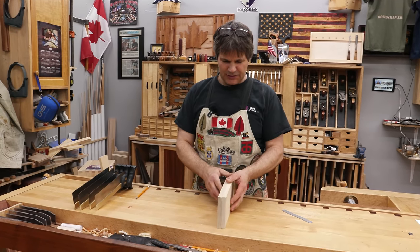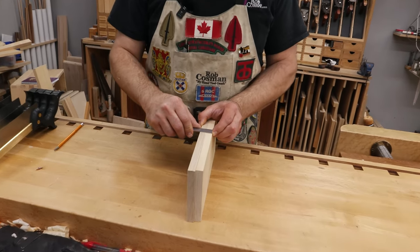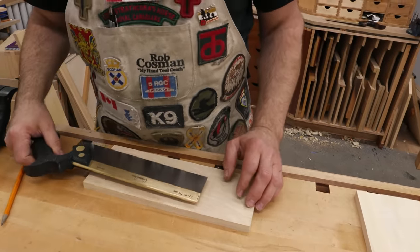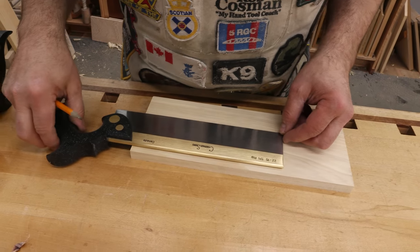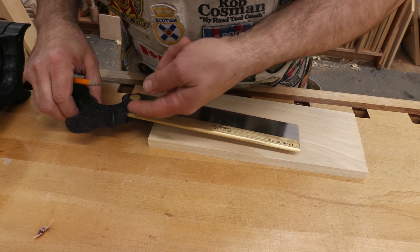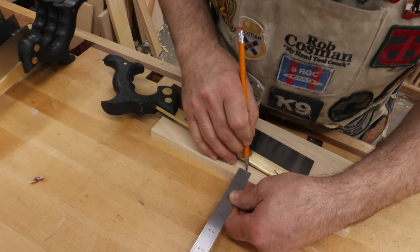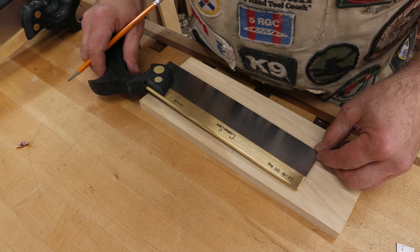I've milled two pieces of poplar and kept them a little heavy so I could hand plane them to a final finish — they're a strong inch and an eighth when combined. We want to lay the saw so that all the handles are in the same spot; the blades are bigger but they'll run down this way. I want this end of the till to come right up against the flat spot. I want a half an inch of material left up at the top so there's plenty there to work with.